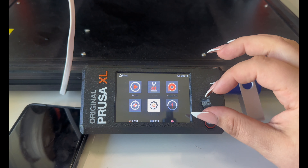To make this process go faster and smoother, the first thing I do is make the Prusa touchscreen. To do so, go to Settings and scroll down to User Interface and toggle touch on. Make sure your printer is up-to-date and on the newest software.